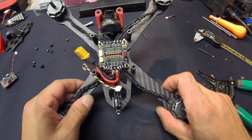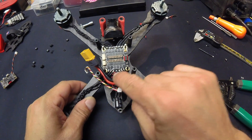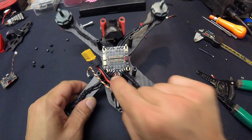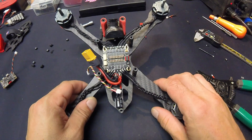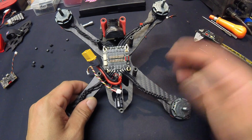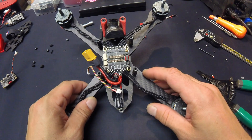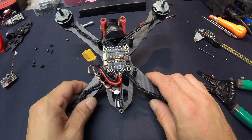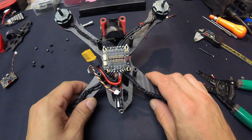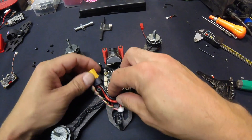Got a little more done while you were away. Power leads, power cap, and the VTX are all tacked right on top of each other on the main power here. I've done many builds this way — with the VTX taking incoming power, it has good regulators. It hasn't been a problem; I've used the TBS ones for a couple of years with good luck. And the power cap — same thing — you want it as close to the noise source as possible, which is the speed control with all that switching and motor running.